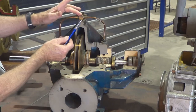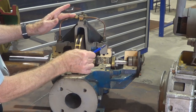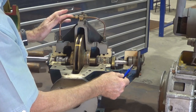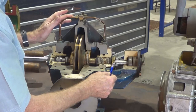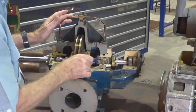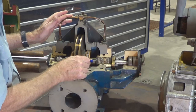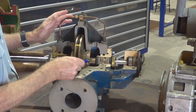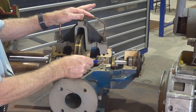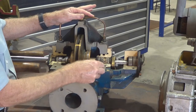As you can see, from the casing we're piped out and down into where the gland is. That's our bearings there supporting the shaft. We've got the gland with the adjusting nuts on it, we've got the stuffing box, and then we've got two rounds of packing, three rounds of packing close to the impeller, and then we have the brass ring there in the middle — and that's the lantern ring.